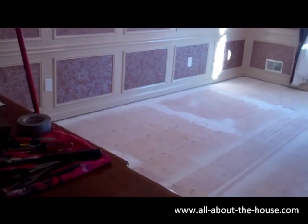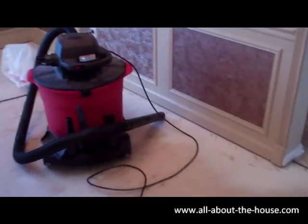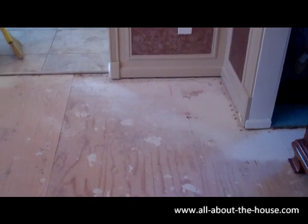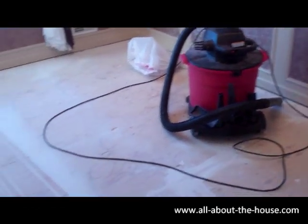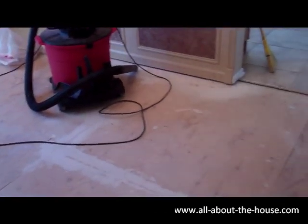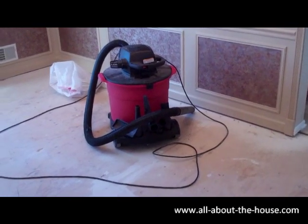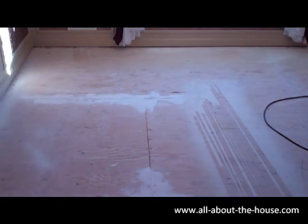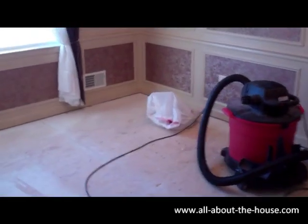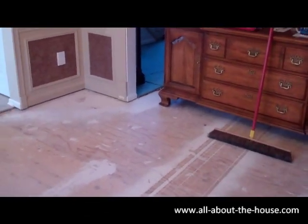A few hours have gone by and you can see the entire subfloor is now exposed and really clean — as clean as it's going to get. The tack strips are all gone because in my case I'm going to do hardwood. So many staples were holding that carpet padding in place and every single one had to go. I cleaned up the floor, checked for nail heads in the subfloor that might be up, banged them down, then swept and vacuumed. I used a shop vac because for a project like this you don't want to use your house vacuum or central vac — this is definitely shop vac territory, you'll be sucking up nails and pieces of wood. This room is now ready for the hardwood floor to begin. This is Mark from All About The House, thanks for watching.